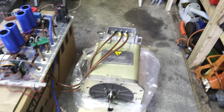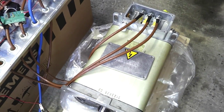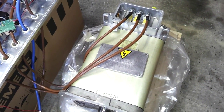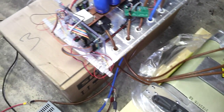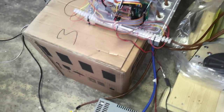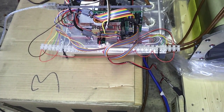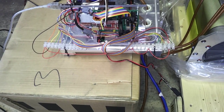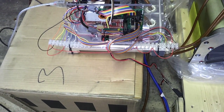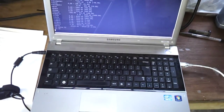On the motor I've got my three phase connections going into the terminal box. I don't have the encoder set up at the minute, which I will need for doing slip control. The inverter hardware is just very basically rigged up with some terminal block on the various IO lines so I can have easy connections. We'll be looking at an amp seal connector and various mods, with a USB line going into my laptop.